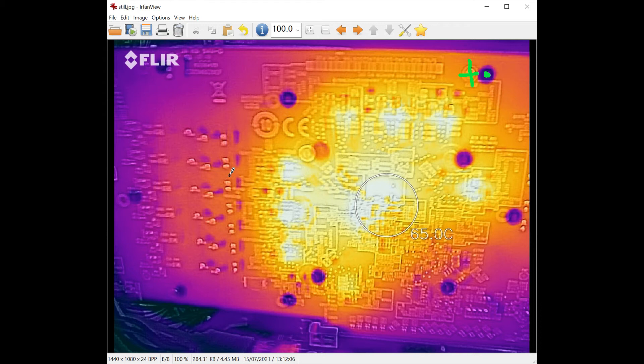This misalignment is because there are two lenses on the front — the thermal lens and then a few millimeters away the normal video lens. When you get very close to the board — about six inches, 15 centimeters away — that misalignment starts occurring. At long distances you can't see it at all. There is actually a software adjustment that allows you to correct for that difference — it's a little slider that moves the thermal and visual image back into alignment. This is a problem with all of them; standalone units do exactly the same thing.